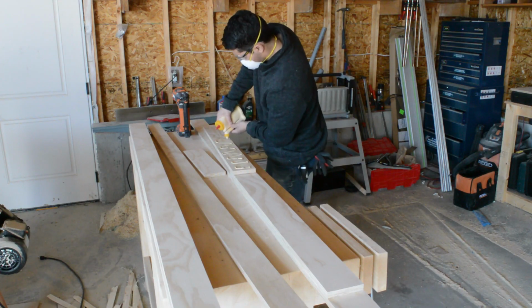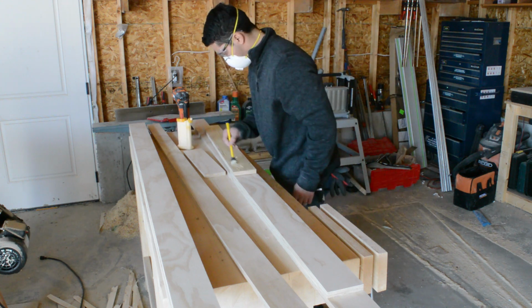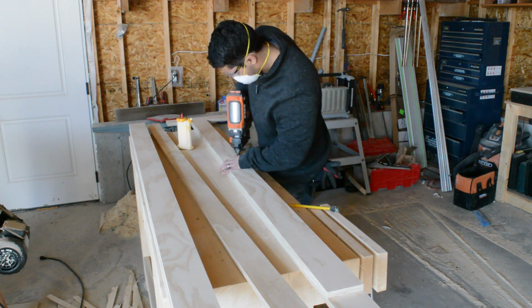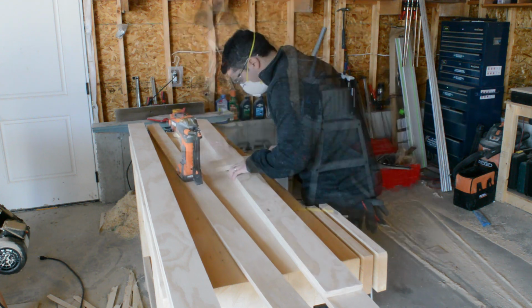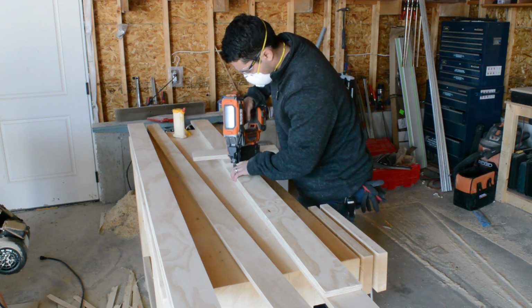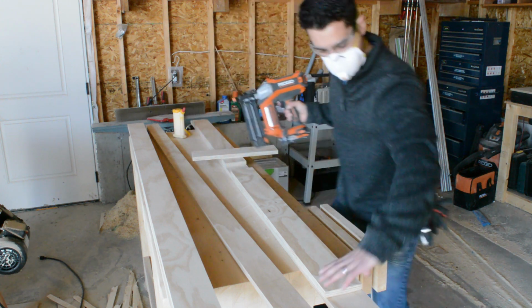Here I'm gluing all my side pieces together. I've used a couple of scrap pieces as stops to ensure proper gaps. You'll notice a sequence of long face piece followed by 2 shorter pieces, then topped with another full piece that is slightly less wide. These are for the longer components. The shorter components are 2 shorter pieces sandwiching a longer piece, again with the top being slightly less wide, by about 3/4 of an inch, which will make sense later on in the video.